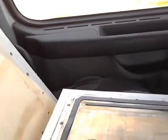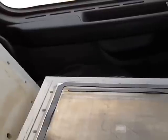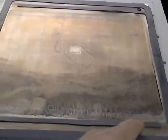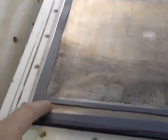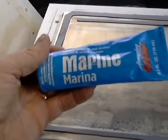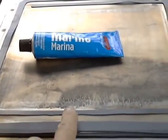Here are the end caps — you can see what they look like, big monsters with an in-and-out. The liquid comes in and goes into here, but the idea is that any current leakage is going to have to come down through this channel and work its way all the way across into the hole. I took this marine goop — this stuff works excellent.